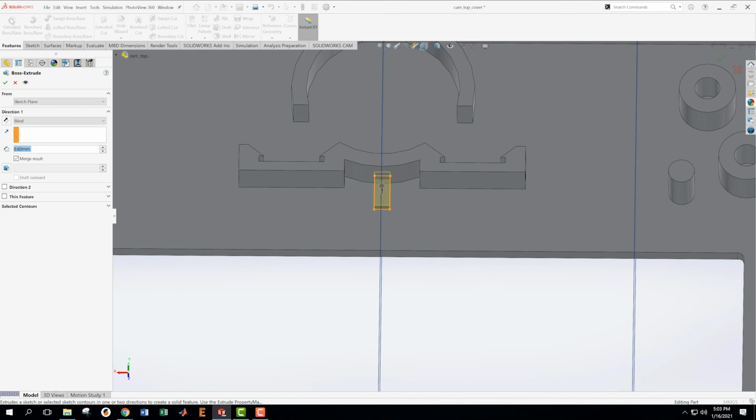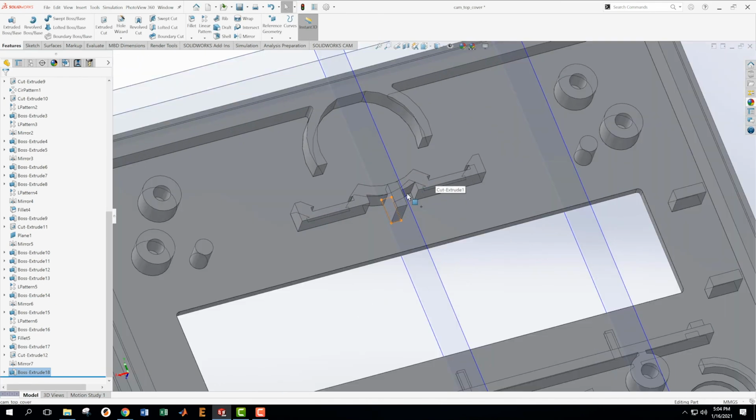Gotta look at the drawing. I gotta find a cross section that's going to tell me that. Okay, section AJ will tell me. That's interesting. Okay, I made a mistake on this other part. So this goes up 3.9. That part that we just did goes up 3.9. But this end of the battery thing is not flush, i.e. this part of the battery. Okay, so let me just fix this here. So this is 3.9. Okay, save that.